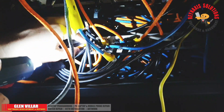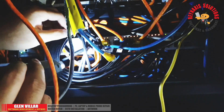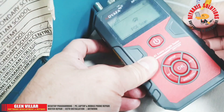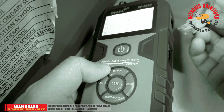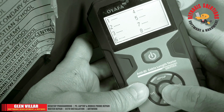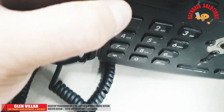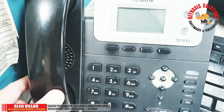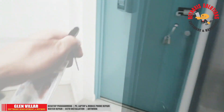Let's unplug this cable from the port and go back to the other side to test the PoE cable if it still has power. Unplug the cable from the scan port and insert it into the port flash port. Now we're going to select the PoE function again and do a test. As you can see, there is no power displayed. And if we plug the cable back to the IP phone, you'll notice that the IP phone is dead. So when troubleshooting a dead IP phone, the first thing to do is check if the cable has PoE power.